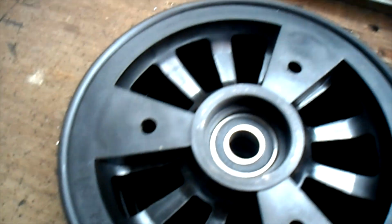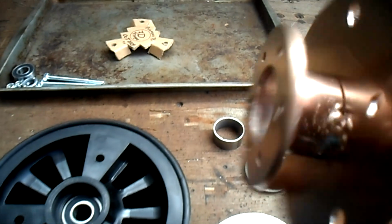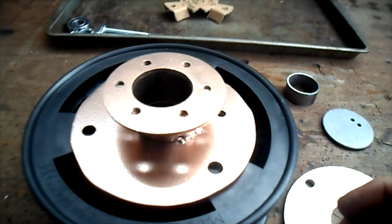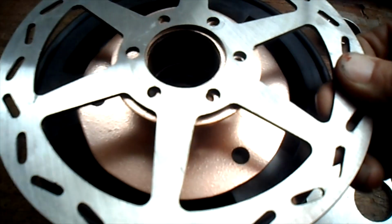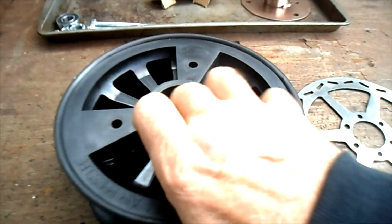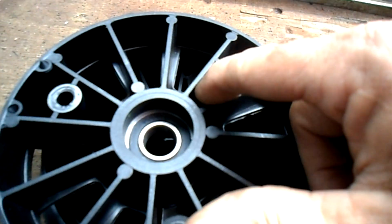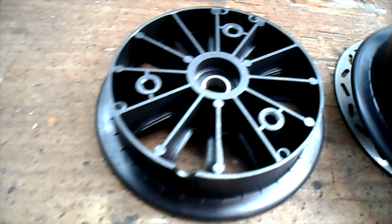Alright, now we got that all out of the way. I went ahead and made up a mock prop hub, that's what I'm trying to say, that has our outer flange to mount to the wheel, has the spacer in the middle type of thing, and then a rotor flange for our rotor. And then a buddy of mine also mentioned that we could potentially fill these voids with epoxy to help beef up or strengthen the bolt holes all the way through.